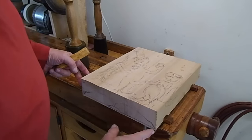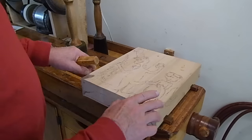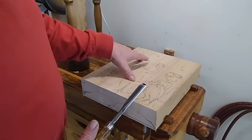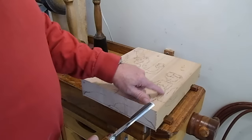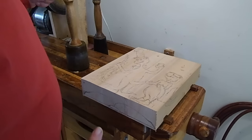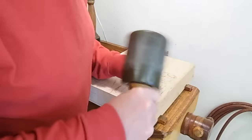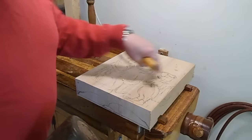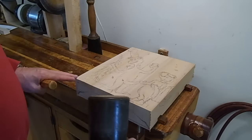I'm making a book — this is the outline of the book that's down away from the top surface. On the top surface I'm doing a Dr. Seuss theme: this is the Cat in the Hat and this is the Fox in Socks. I've kind of put them together, and the Fox in Socks is holding the tail of the Cat in the Hat. That's going to be raised above the book. I'm doing the stop cuts and then I'm going to cut down the background so it conforms to the pages of the book.